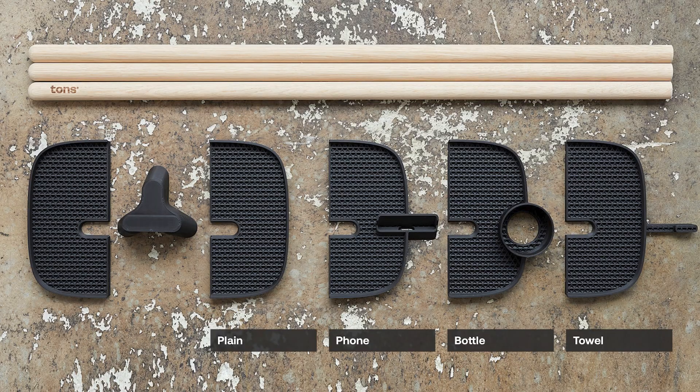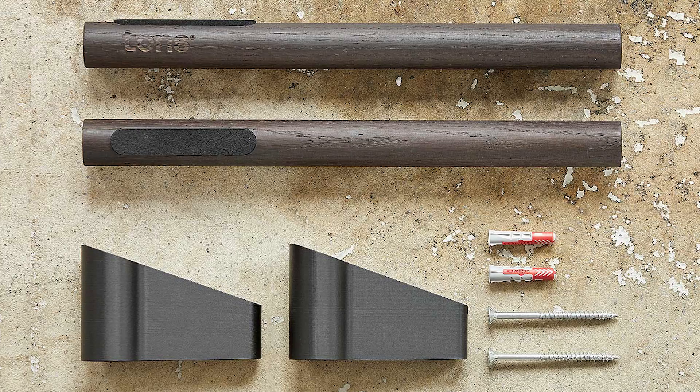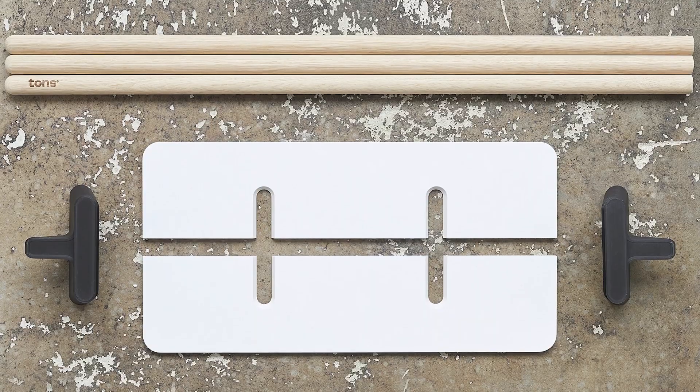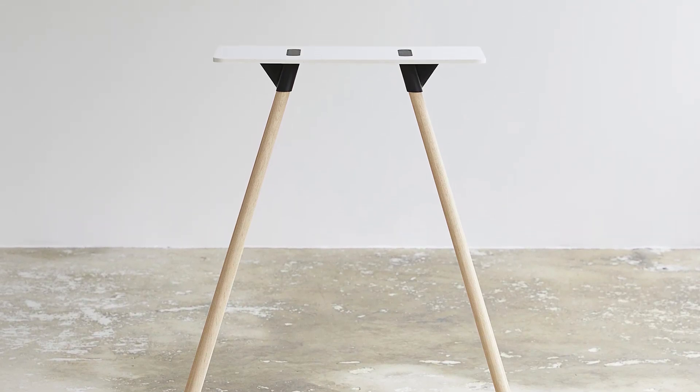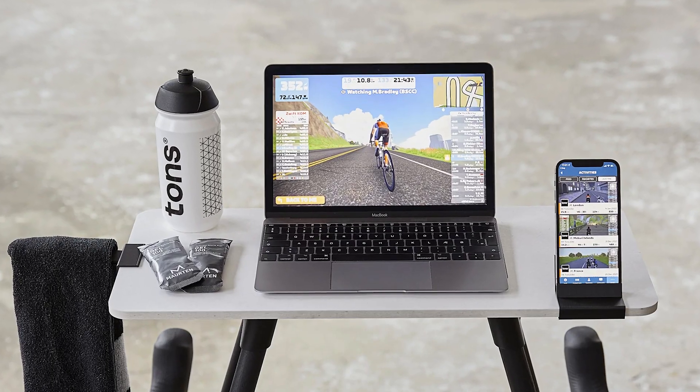This is really easy to do, whether you're making it yourself or hiring a service like Slant 3D to manufacture your products. Simple third-party components with basic assembly steps — either completed by the customer or within a factory setting — is a really good way to design a product because there's not a high manufacturing requirement around tolerances or assembly or processes. Everything is very obvious and clear how it goes together, creating a very nice looking product because everything is so intentional.